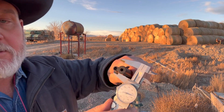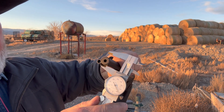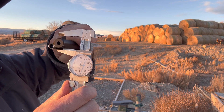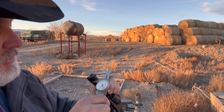I've already taken about 20 thousandths off this front sight. I'll show you how I measure — I got my calipers out here. The whole trick to this deal is to get consistency. I pull the ejector rod up, set the calipers next to that, and put it down. It's reading about 930 thousandths, so I've taken about 15 or 20 thousandths off of it.